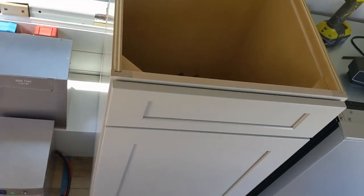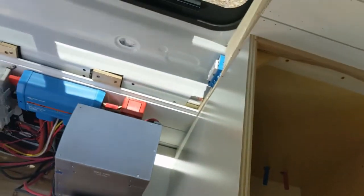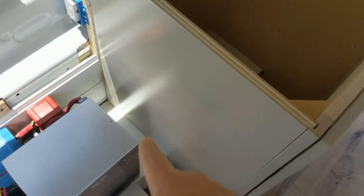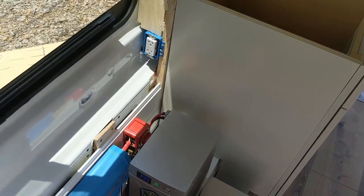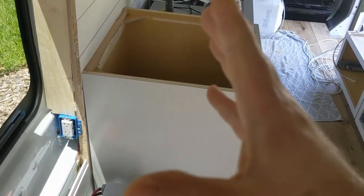Now, the kitchen sink, I cut a notch, and in hindsight, I didn't measure or account for the curvature of the wall, of course. So I measured from the wall at the base out and down. So now I've got a nice little gap there, which is lovely. So it's a 1/2 inch off because of the curvature. As you can see, it starts at the bottom, it comes out, and then it touches the wall. So I can't cut this portion of it because then it's going to push it too far.